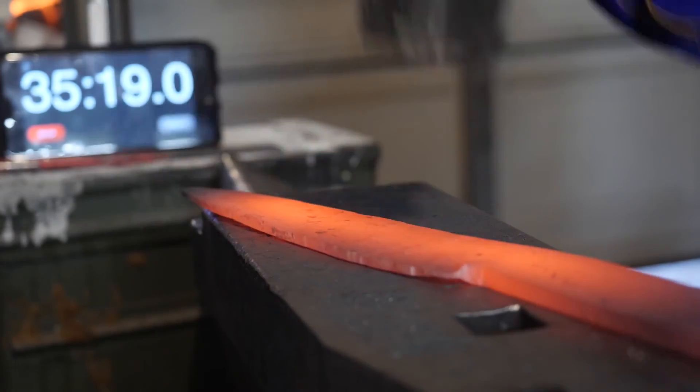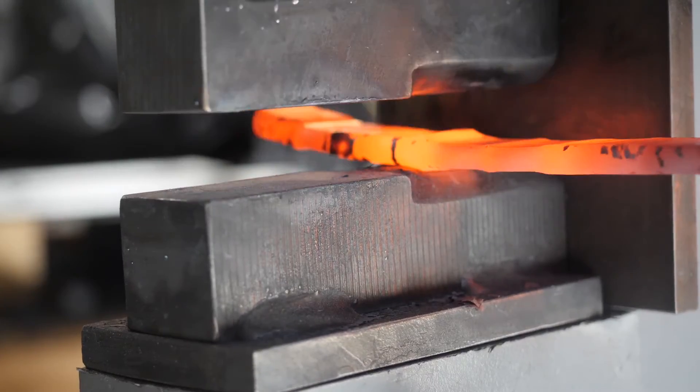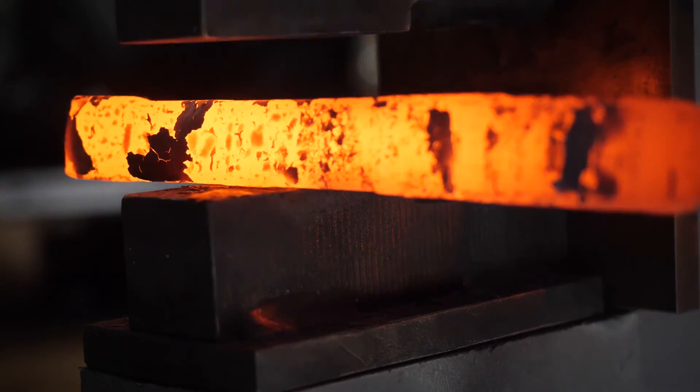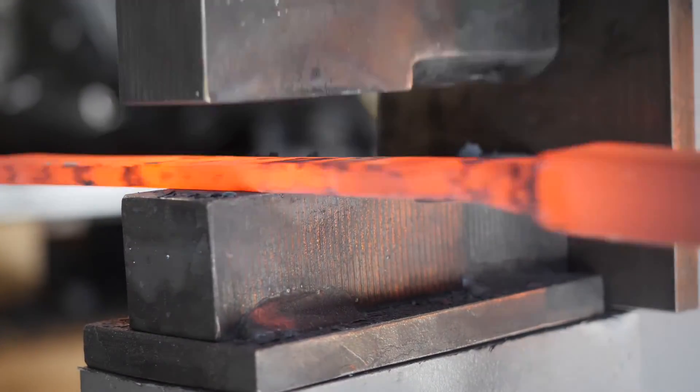Second, I'm thermal cycling immediately after forging, so despite turning the PSI way down on my forge it's still very hot and it quickly heats the knife beyond desirable temperatures. It's challenging to get things to the cherry red colors and only slightly hotter needed for normalization than quenching.